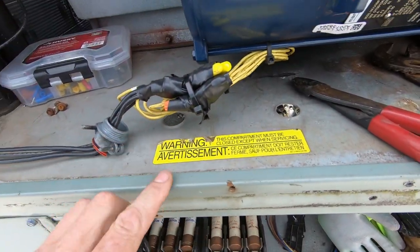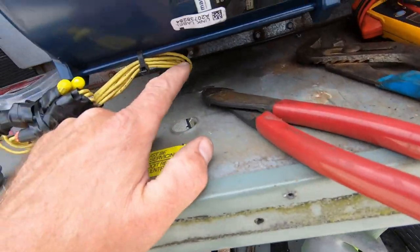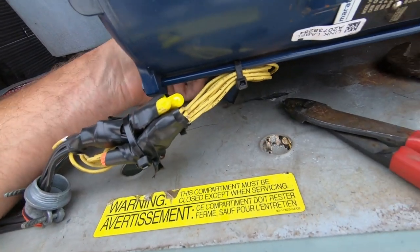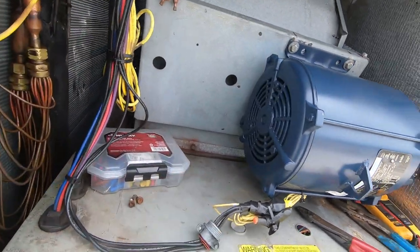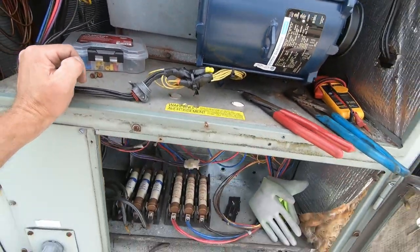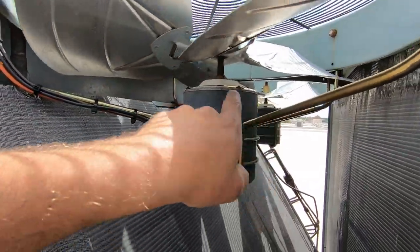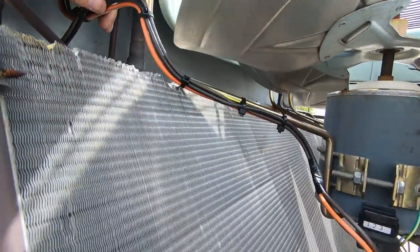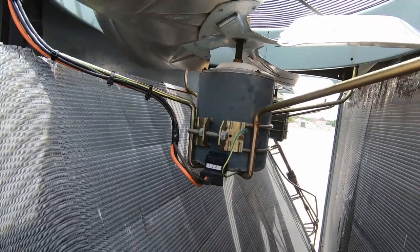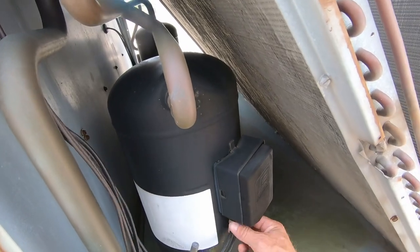That's why it's wired up like this. That's about the best I'm going to get it for now - I just zip tied it up so nothing was touching. I'm going to get a 2x4 box with some half-inch seal tight, just to get it up in the motor a little bit so it's not rubbing on a raw edge and get everything contained inside a 2x4 box mounted there - that way we don't have any wires flopping around. I already rerouted these condenser fan motor wires - taped up where it was starting to rub out.